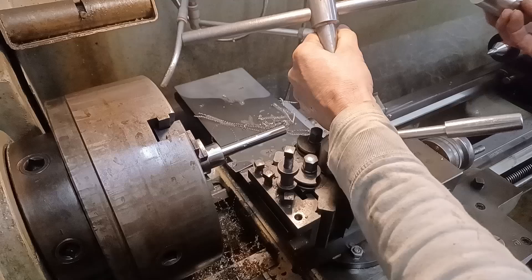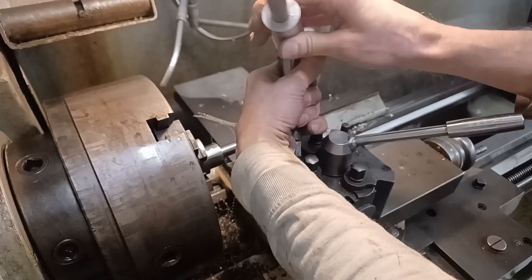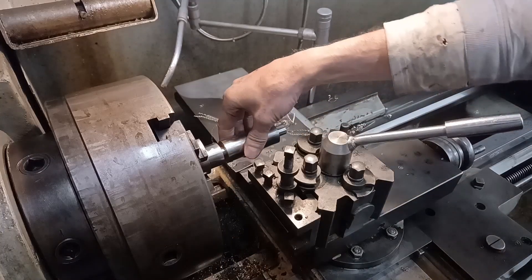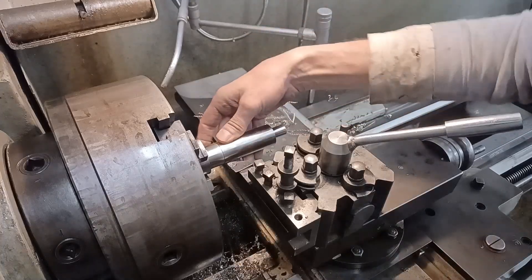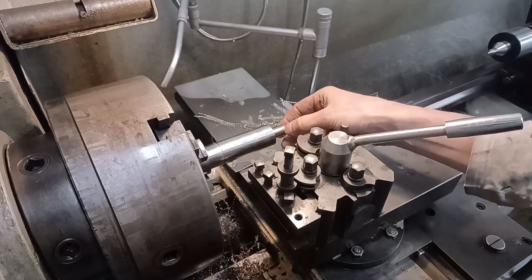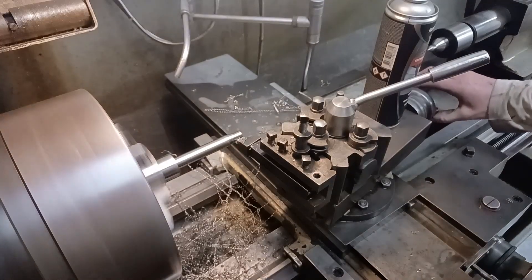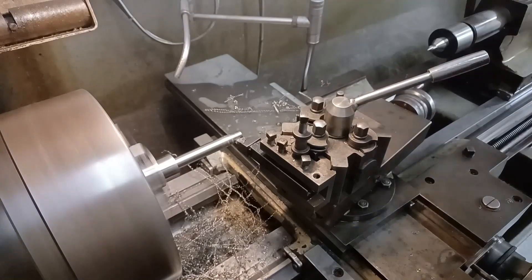Actually I didn't need to. This is a sort of test bar that I've been using, because I haven't got any 5.8s — I have ordered some. So that's a piece of test bar, and it's exactly the same, so I'm pleased with that. I might just put a little bit of a taper on here, to help it over the O-rings.